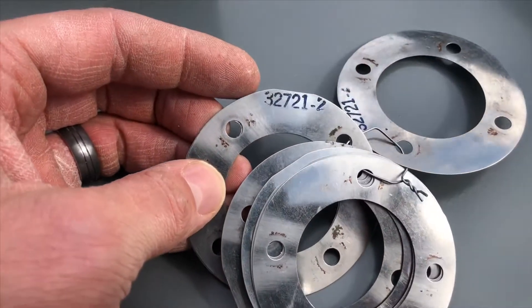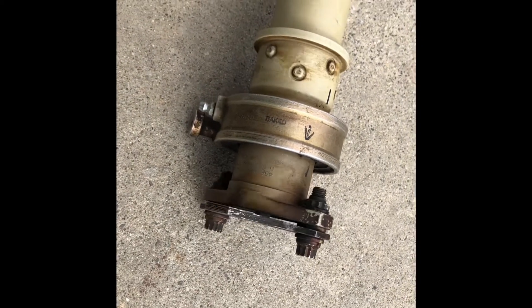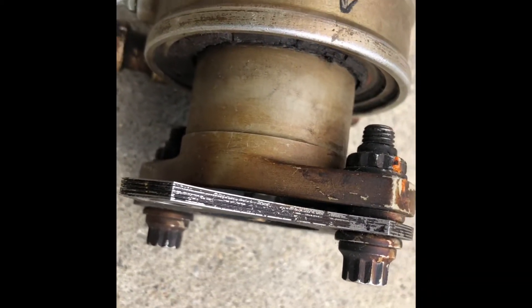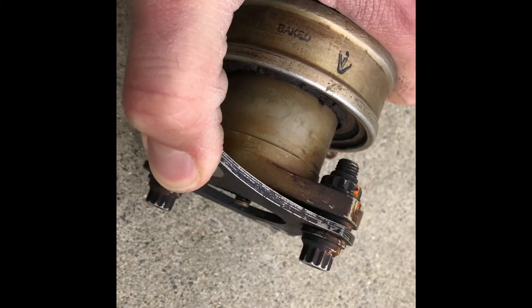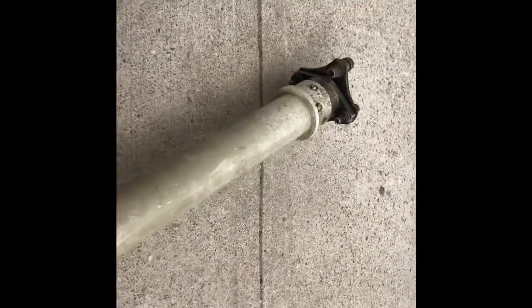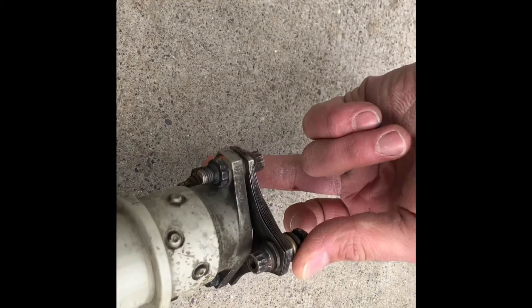The flat portion on the disc helps indicate the direction. This is a section of tail rotor drive shaft, and you can see the Thomas coupling on the end with the laminations. Following it down to the other end, you can see that this section of drive shaft is attached here, and the corresponding next section would connect 90 degrees from it, allowing that flex to occur.